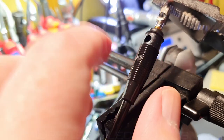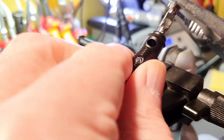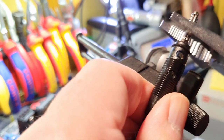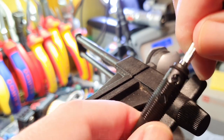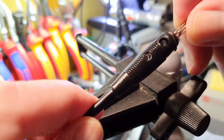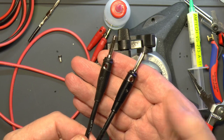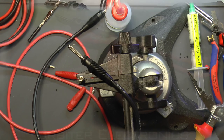We've got a nice contact there with the insulation right up to the connector. Now we have to push the outer cover over the end of this plug. I get a load of IPA and pour it in at this angle so it's all full, get my fingernails behind it and start to pull so the outer cover starts to move. Now it should all be covered in IPA inside and we just push it and twist very lightly. We keep going until the hole is perfectly in line so another banana plug can go through it, confirming the cover is on properly. And there we have a done plug — that's how I make my own silicone cables. Just a couple more to do and that'll be it for today, thanks guys.